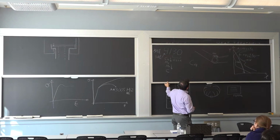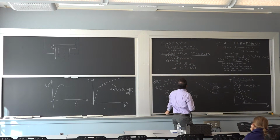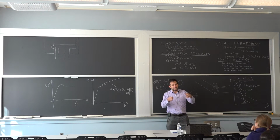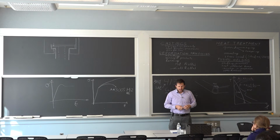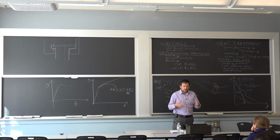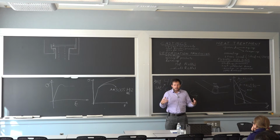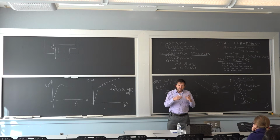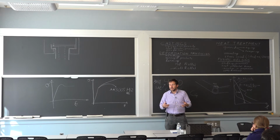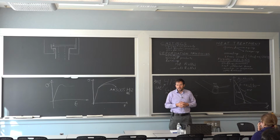If we go back to our outline, like you have in casting, you do have porosity because you're bringing together a bunch of little particles. So I'll just describe it briefly, then I'll circulate this around. You take the powder, and there are two main ways to make it. You can mix powders, and that's done very often now. Let's say you want to make a tool steel, so you might as well bring some carbides with a matrix together. That's a very, very efficient way to do things.